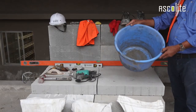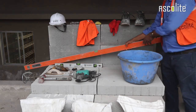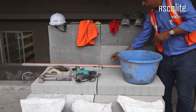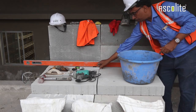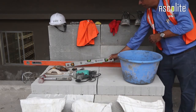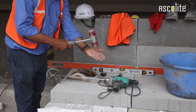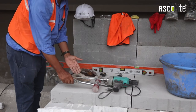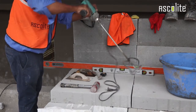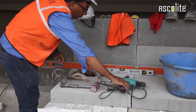And some useful tools. This is a plastic bucket and it is used for mixing mortar, gypsum and plaster etc. This is a spirit level 2 meter and it is used for levelling of complete course and wall perpendicularly. This is a spirit level 2 feet and it is used for AAC block levelling while jointing. This is a rubber mallet and it is used to remove any air gaps in between the blocks for proper jointing and alignment. This is an electrically operated hand mortar mixer and it is used for mixing mortar or tile adhesive etc.